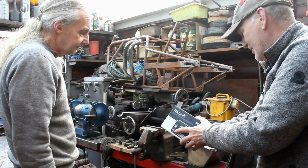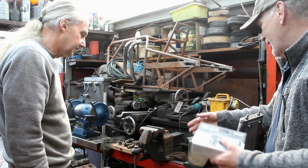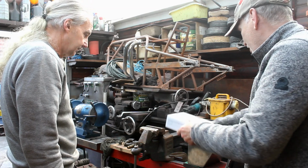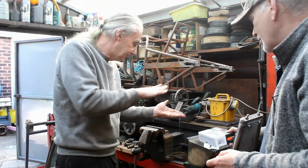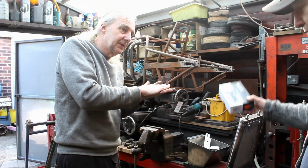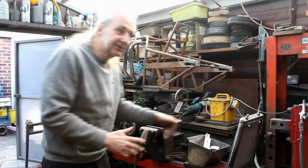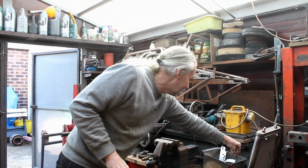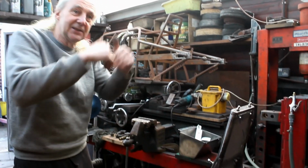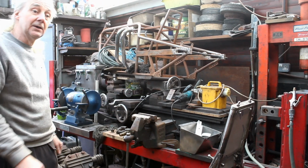Well, so I thought, right, it's such an odd shape this that holding it and drilling it at the same time is quite tricky. Yeah. So I thought, right, I'll bring this along. We can hold it, drill it, done and dusted. It's not bad. You have to get the drill. We'll have to put something like a piece of wood and G-clamp to it, spin the table around. Yeah, it's a bit involved to do it right. It's a very awkward shape. Try and sit that on its side and then try and drill it. Yes. And well, you've got a centre punch anyway, so dot mark it. Yes. Hopefully. Yes, that's what I brought this for.